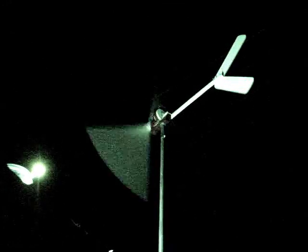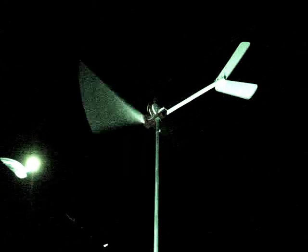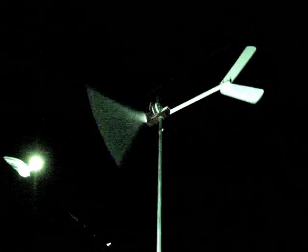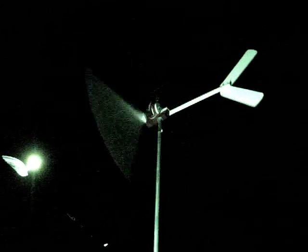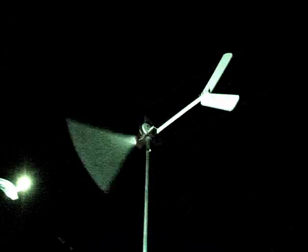Listen how smooth that whirring sound is — that's the magnets passing the coils. Gotta love it. The dump load came on and went back off. Not including all the lights inside, I've got a fluorescent out here and the LED out here. Like I said, it keeps dumping a steady three amps pretty much into the battery. I haven't seen it go below three amps very much.